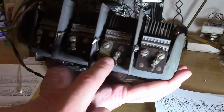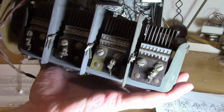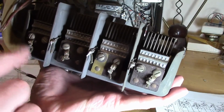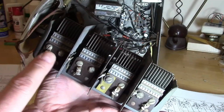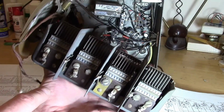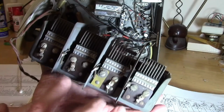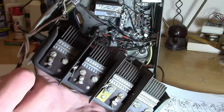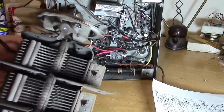And then here are the 4 isolated fixed plates, and the connections that go down to the radio. So if I wanted to swap this with the one that's in my radio chassis right now, you have to do 4 independent wires coming down, the 3 ground connections, and the dial lamp up front. That's why I didn't want to mess with it.